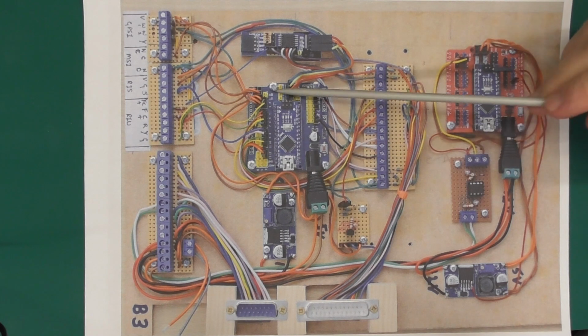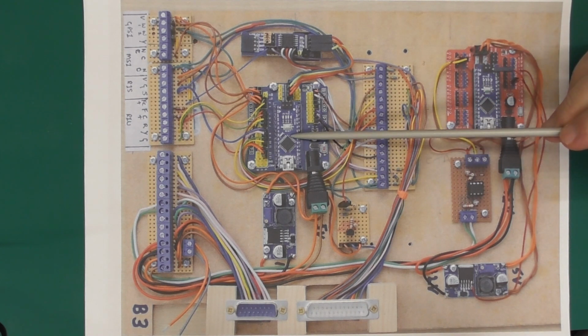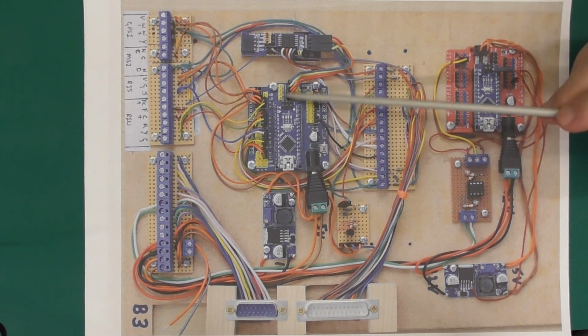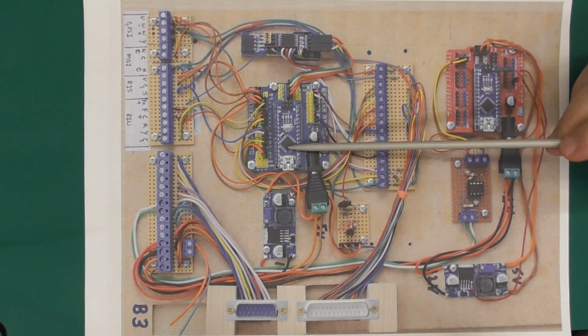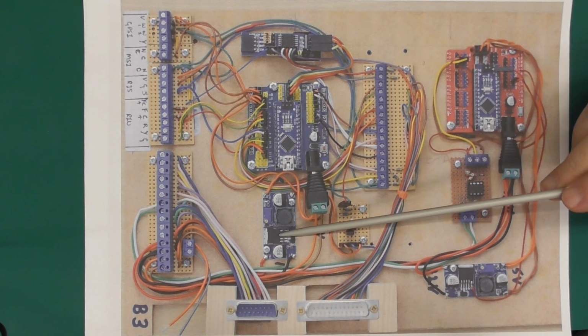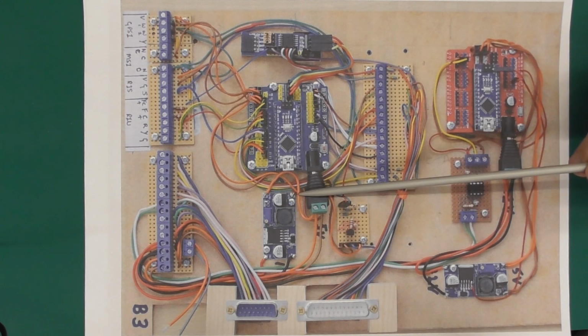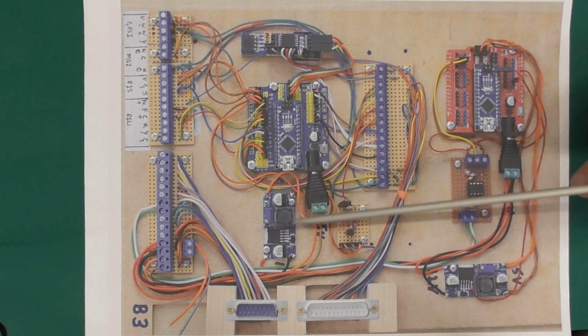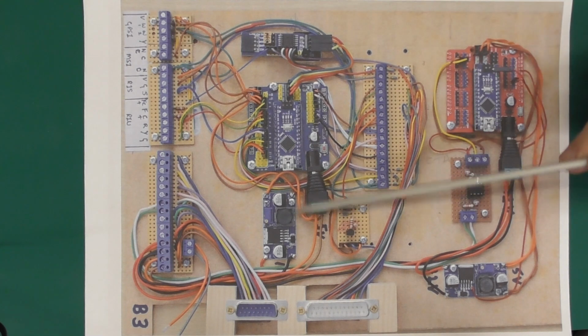Okay, so this controls two signals, either an up and a down on two different tracks, or an up and a down on a bidirectional track. This here is purely a 5-volt output from my 12 volts up to 3 amps, which is one of the two of these that there are driving all of the signalling. My signalling could take 3 amps if you had just the right conditions.